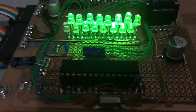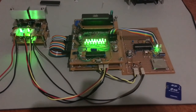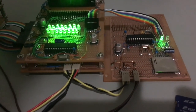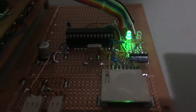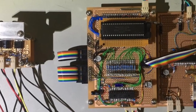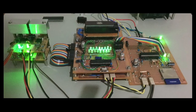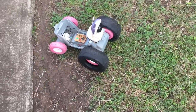At this stage, before getting the hardware ready for writing an EPROM, which basically involves supplying the programming voltage, I've done the verify routines, which verifies against a source file, and this one here is showing blank checking, so there's a blank checking routine as well. On the board to the right, where there's a single green LED, there's also a red LED that only lights when something goes wrong, which is a blank check failing or a verify failing. Oh, that's backwards.